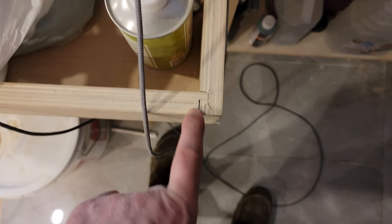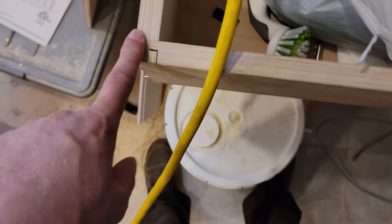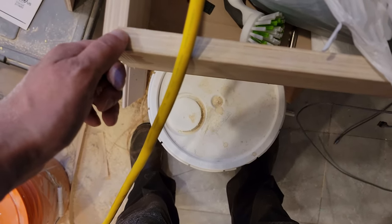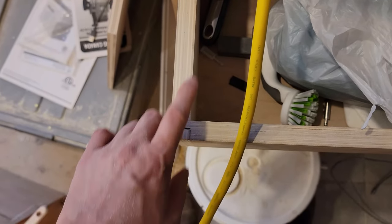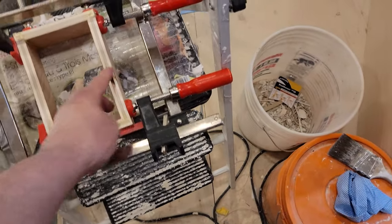This will be hidden by edge banding, which I just ordered tonight. But the edge banding will also cover up the lock miter. So these will be half-inch — this is three-quarter inch — and I'm going with half-inch. I think that's more realistic for kitchen drawers; they're never going to be put under undue duress.